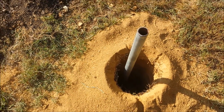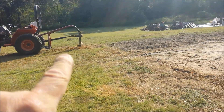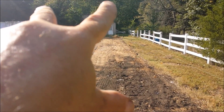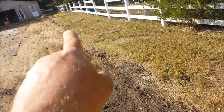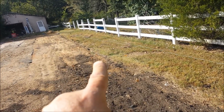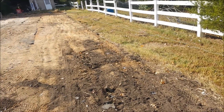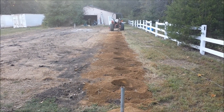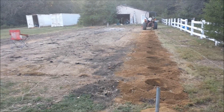Digging the hole is about 30 to 32 inches deep. I've got the four corners done. I'm going back to the first one I started digging — I knew it was going to be the toughest — and I've got to make it a little deeper. I've marked out each spot with a little white paint. You can see the string. I strung it from that corner all the way to this one nice and taut, to make sure I have a straight line, and measured off every four feet, so I'll be drilling the holes there next. That is the end of day one — a little better than half of this row drilled and the four corners. Back tomorrow.